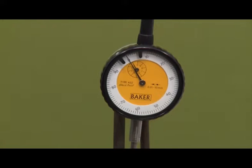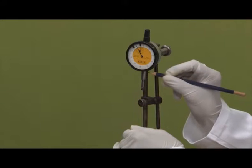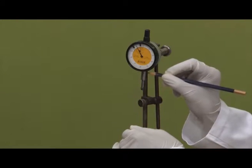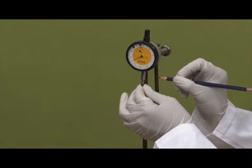So the range is 0.01 to 10 mm — the minimum reading it can give is 0.01 mm and the maximum is 10 mm. If I push the plunger completely, it goes beyond 10 mm but the readable range of the instrument is 10 mm. Above the plunger we have the stem in which the plunger moves. The reciprocating motion of the plunger gives circular motion to the needle.